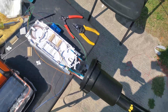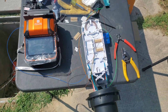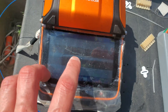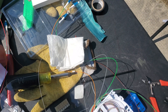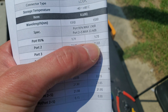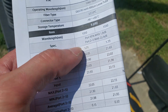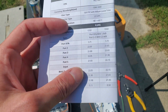Got talking with one of my neighbors there a little bit. Got our splitter in here — unbalanced — and I got my first splice down, just did my second. Went ahead and checked our power, which was just fantastic. I was supposed to be at a negative 17; I'm at negative 15.95.